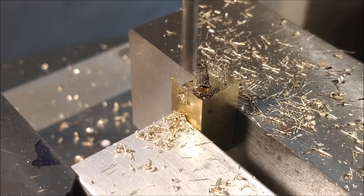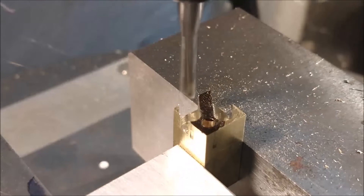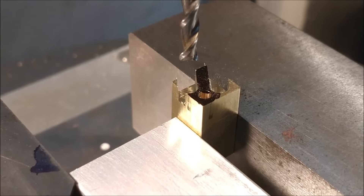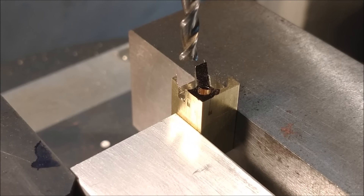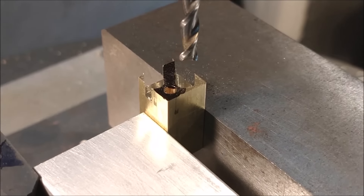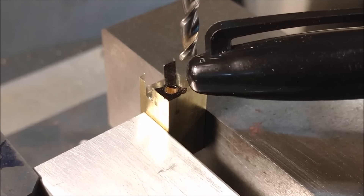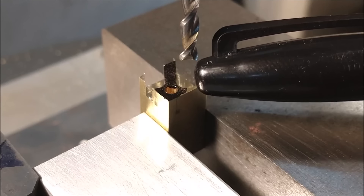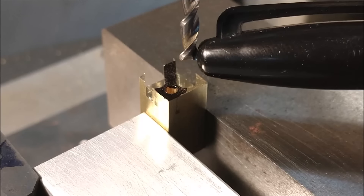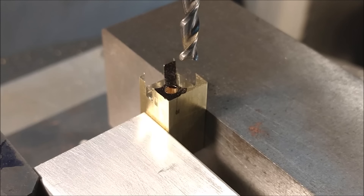Climb cutting the one side, on location, to the left side — climb cutting out. The Y-axis centerline is correct, but the X-axis centerline was offset by ten thousandths. I'm going to interpolate the end off of this piece, then return to this position, put it on true position, and take my final cut as a climb cut.